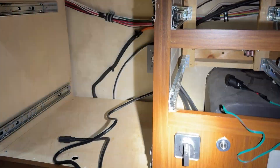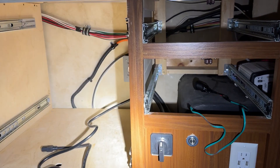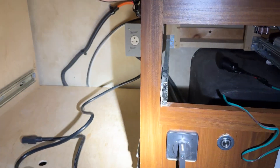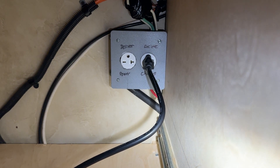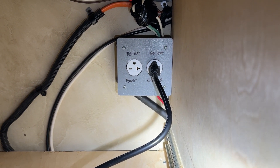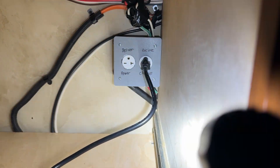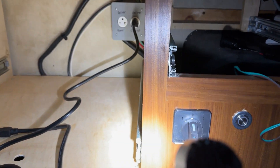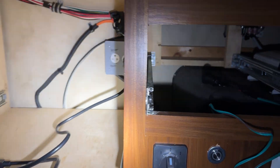What I did was help them figure out a wiring solution to hook it up so they can not only power the camper but have a couple of options to charge it from the camper, making it more hands-off. We put in these two outlets here. The one on the right — if they're plugged into a power supply at a campground or at home — they put this selector on two, which energizes that right-side outlet and charges the power station. Selector on one energizes the left outlet, allowing the power station to power the camper.